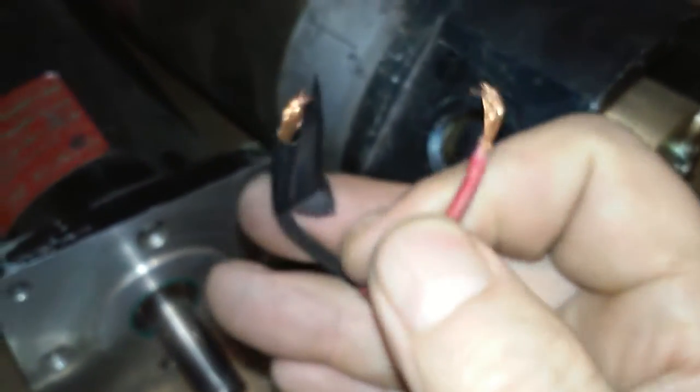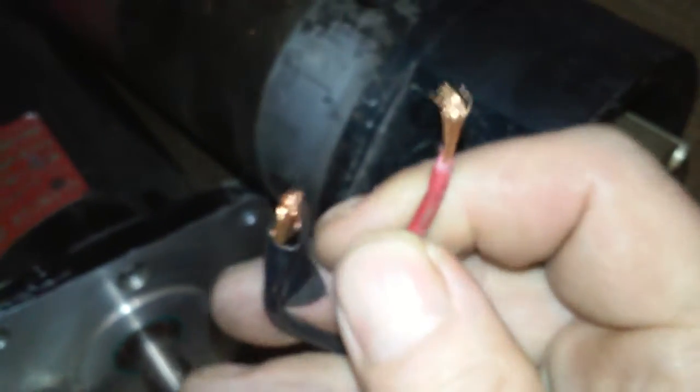This is the motor input. Now if you ever have something stuck and you need to get it loose, you can connect a battery charger — or a 48 volt or a 90 volt DC power supply — in there and you can drive these motors. It's a pretty quick check to find out if a motor is totally shot.